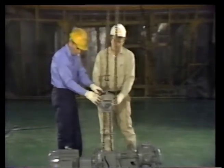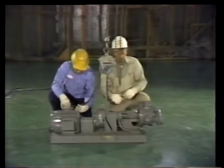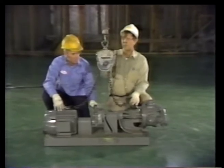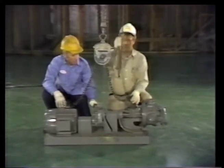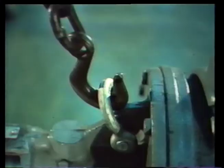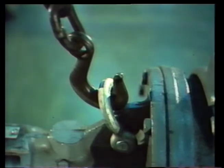A load leveler can be hung from the load hook of the hoist. Then each of its legs can be used as a chain sling to attach to the shackles on the load. This is a 2-leg rig, so it'll naturally be slightly less stable than a 3 or 4-leg rig. Whenever hooks are used on an angled sling like this, make sure they're placed with their open sides pointing out. That way, they're much less likely to slip off the shackles if there's slack in the sling when landing the load.